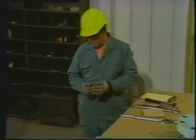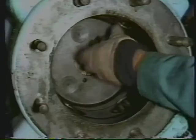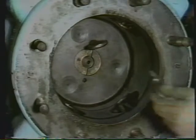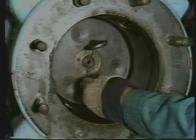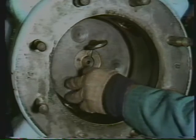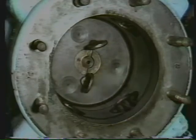The next step is to install two eye bolts into threaded holes in the top of the piston. These eye bolts will perform two functions. First, they'll act as handles to allow the workman to turn the piston and piston rod so that he can unscrew it from the crosshead assembly. Also, he'll be able to use the eye bolts to pull the piston and piston rod free of the machine. The preliminary steps are completed now. With the cylinder head and inspection covers out of the way, the workman can remove the piston rod from the crosshead. Before we go on, stop the tape and review the steps we've seen so far with your instructor.